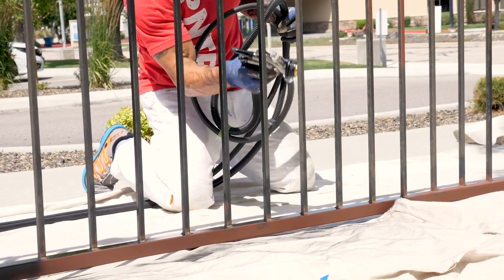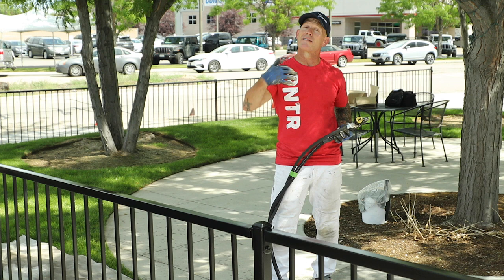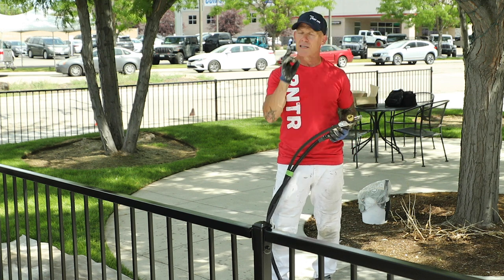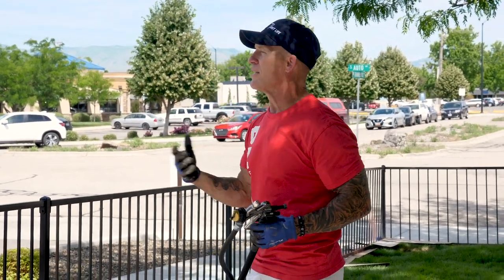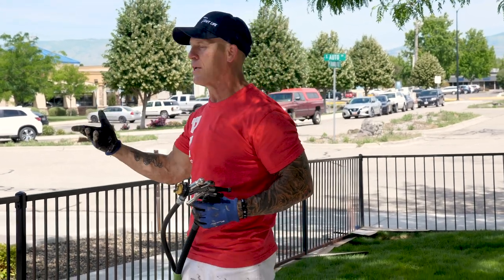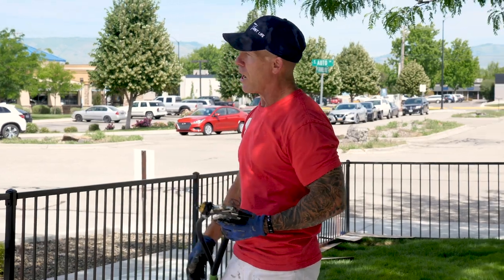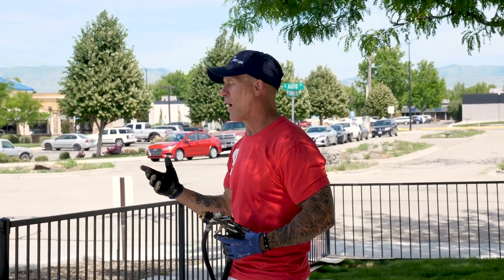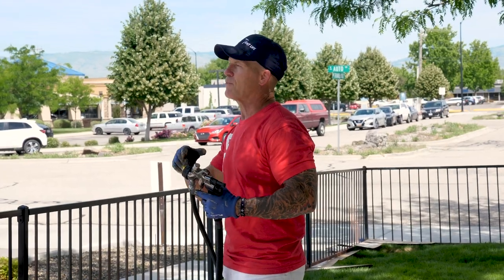I've got it dialed all the way down to a circular pattern, and one of the things about that is it slows down the spray-on process. It's a very small pattern. I've got the material dialed down significantly, but we got a slight breeze around here. It's an oil-based product, and one thing you don't want is overspray problems, claims, and liabilities. By dialing it down like this, you can significantly control overspray. I've only got overspray falling out from the fence about a foot.